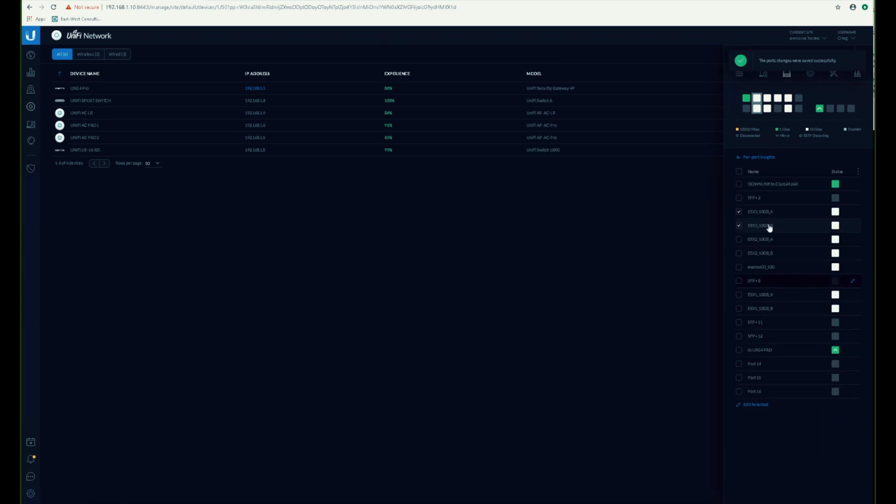Okay, the reason you name these ports is to make sure that once everything is connected, it's much easier to find things once you assign a name to it, because sometimes you don't really remember what is connected to where, and going back to the data center and tracing your cable is not really a good option. All you have to do is some prep, and once you get cables connected, spend another maybe 1-2 minutes to update the names, and that way you're going to be okay.